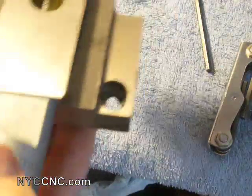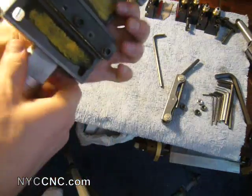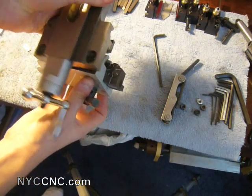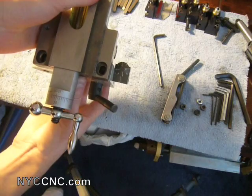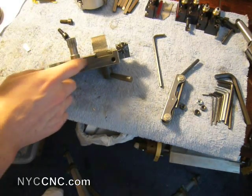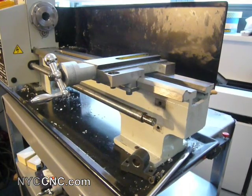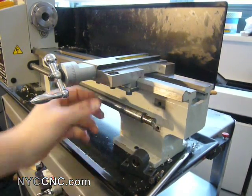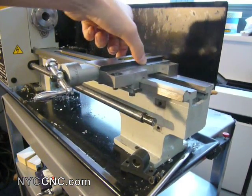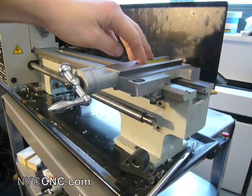Just in case you were confused — now that you can see — this is the part I'm working with, and in order to get to the front gib I had to remove the piece here, which is where you've got your half nut and your carriage assembly rack and pinion piece. One reason it's really nice to take off the bottom assembly is that it makes it much easier to slide this part on and off the lathe, you don't need to worry about where the lead screw is, and it's simply lighter — not fun to drop one of these on your foot.